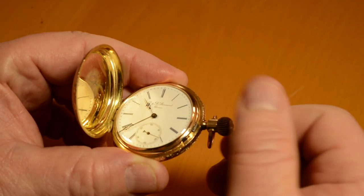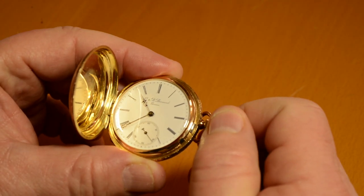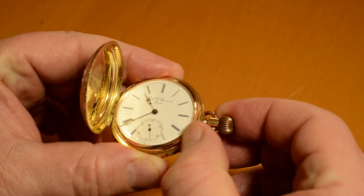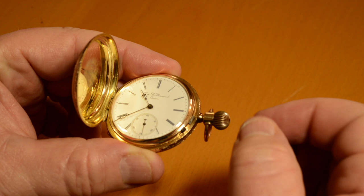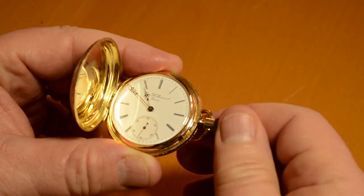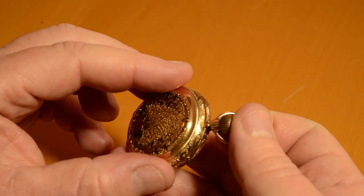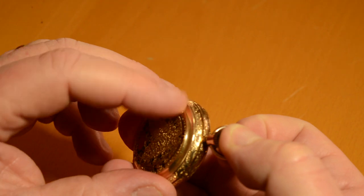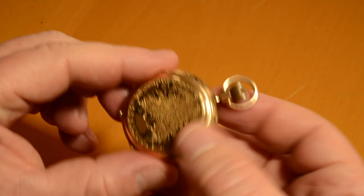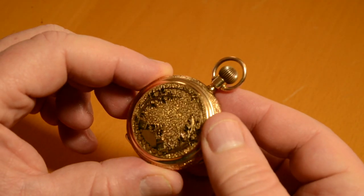This is fully wound, but when you go backwards it's clutching and when you go forward it's winding. So just wind the watch up, pull this lever up — or if yours goes out, pull it out — set the time, push the lever back in, and you're ready to use the watch. Then remember when you close it, push in on the crown, push it down, and then let go so you don't wear out that case snap. It's pretty simple to use — this is a manual wind watch.